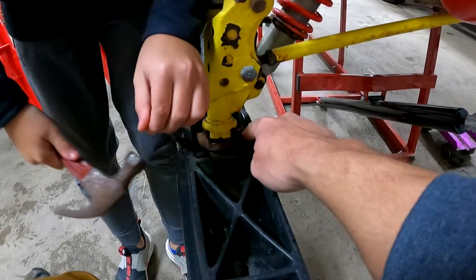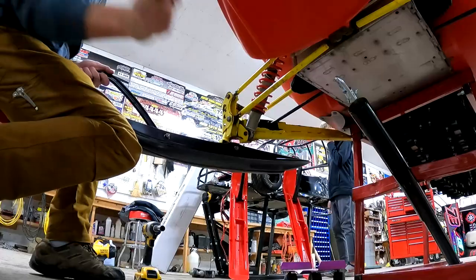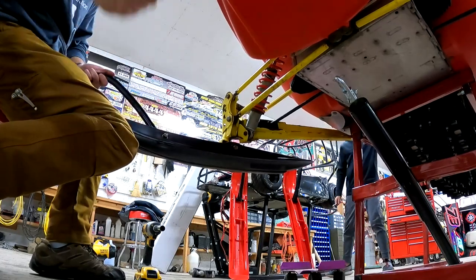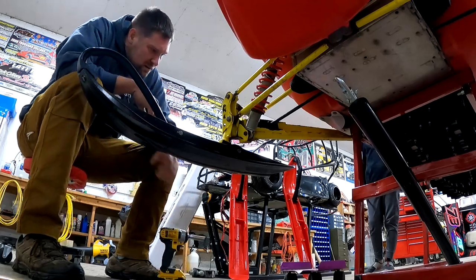So this bolt is really rusted inside there. Hand me this. There's no threads in there that we're fighting. It's just simply rusted through that bottom spindle piece there. So I'm not messing around. We'll go to the other shed and get the 3/4 inch impact put on there. If it doesn't break it loose, it'll at least break it.